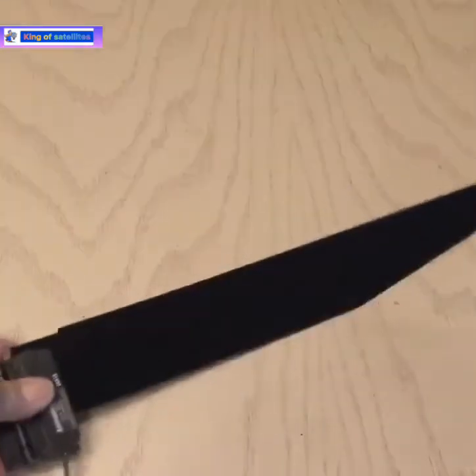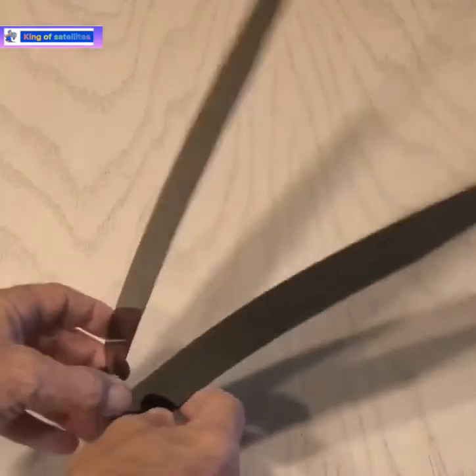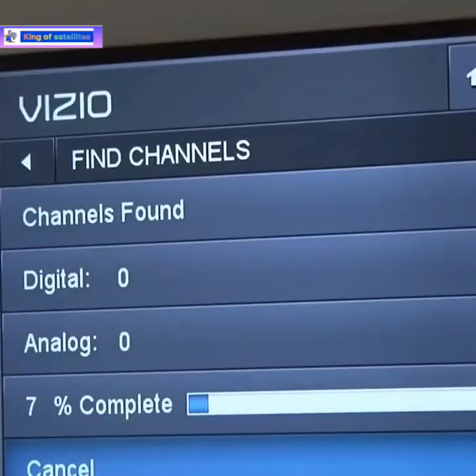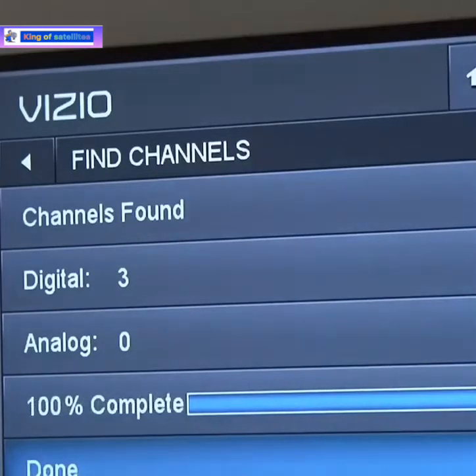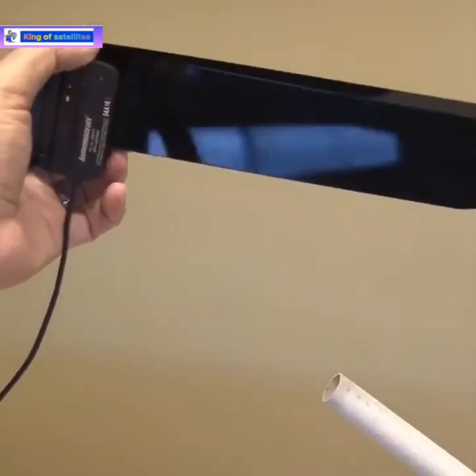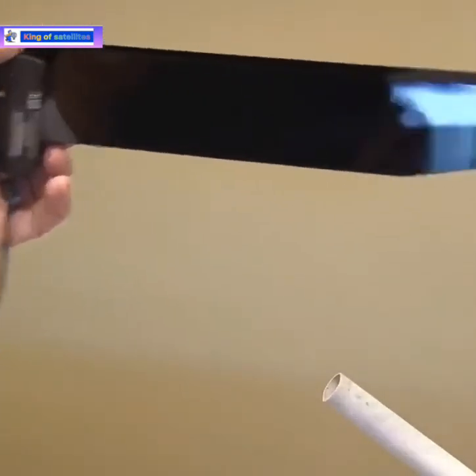I have this little over-the-air HD antenna as a backup in case my other sources of TV go down. But I have to be honest — I put it outside and was only able to grab three HD channels. A little disappointing, but what do you want for ten bucks? So it's time to turn this into a long-range HD TV grabber. Like all of these projects, it will require the removal of the LNB, and we're going to want to mount this antenna facing into the dish so the dish can grab the signals and shoot them into the TV.